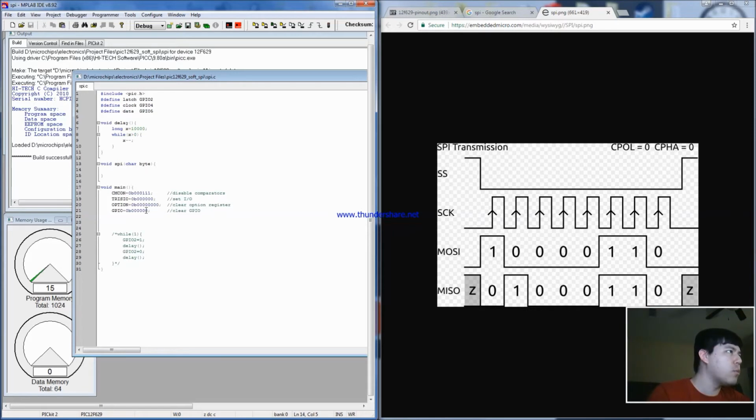So what we are going to do is just to make sure, so we said GPIO2. So basically from right to left here, so this is 0, 1, 2. So the third bit in, let's just initialize that to high right now. And so that'll make sure that as soon as the chip starts up, it's always high.